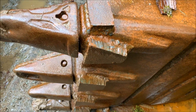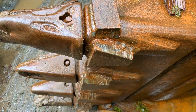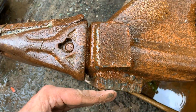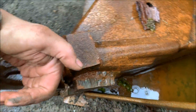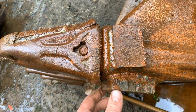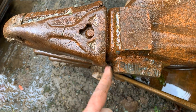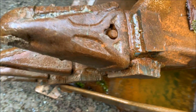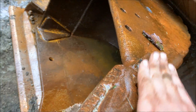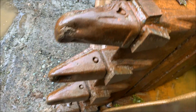So you can use your old cutting edges — this one has a new one — but never throw away any hardened steel. If you weld these on here, now when they're back-bucketing, going backwards to rake stuff away from the tracks — concrete, rock, stuff like that — the back of this tooth will never catch, because that's what pulls them off. And I did them on the sides too, just so that that's the first thing to hit, so anything would graze over it and not catch the side of the tooth and cause it to pull.